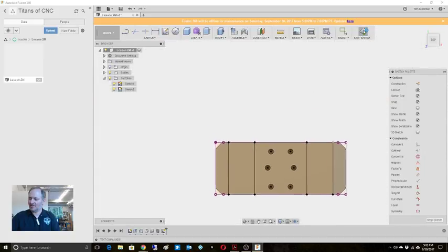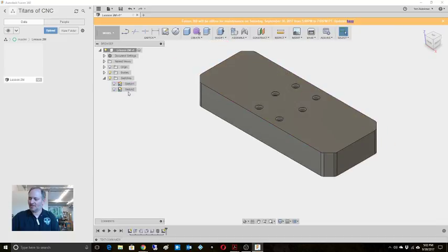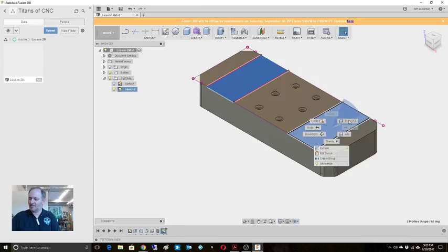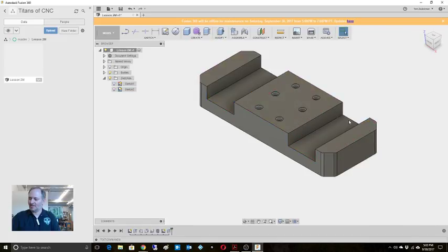Okay, let's stop the sketch. Let's go back to our regular view. We'll turn those other sketches off. Whoops, we need that one on still. And just so, if you guys are following, I clicked here, I pressed the Control key, and then I clicked the other one, right? Now I'm going to right click, we press pull, and that is actually supposed to go down to -0.400. Can you guys see that little mosquito that keeps flying around here? All right, -0.400. Yeah, good.